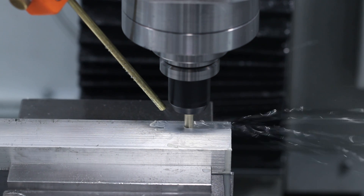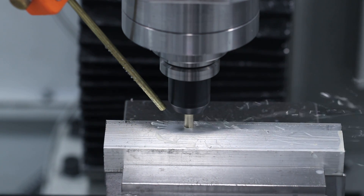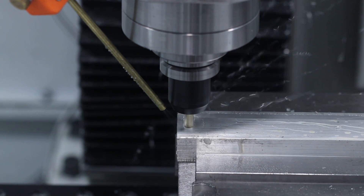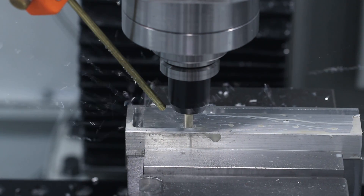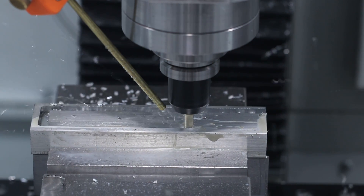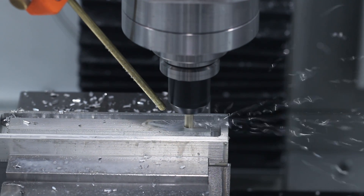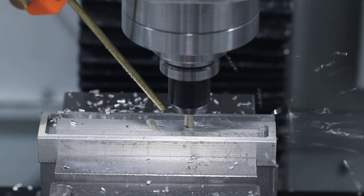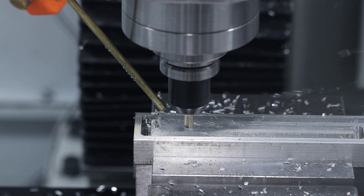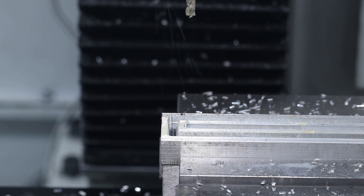When you're building up a slotting recipe, the cutting conditions have to match what you're trying to accomplish. One of the key things is how long is the tool in the cut. We're taking a relatively small piece of material and snaking around to get about 17 linear inches of cutting. That linear distance is really important because the longer the tool's in the cut, the more likely you can build up heat. You can't test a slotting recipe on a short one or two inch length and then assume it's going to work for something multiple times longer. Unlike adaptive recipes, where if it works for a short distance, it's going to work for the rest of that cut. Your eyes and ears are your friend — you want to see good chip evacuation and listen both to the spindle and for any changes in the sound of the cut.